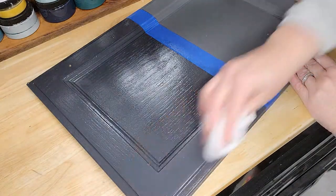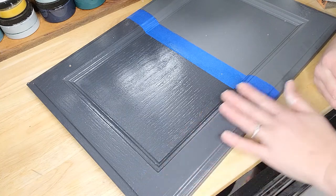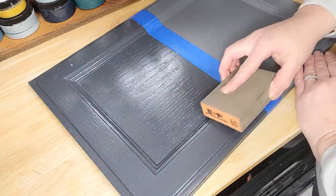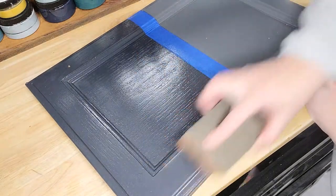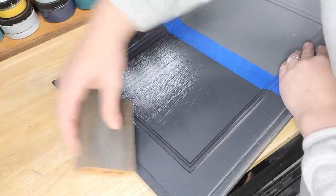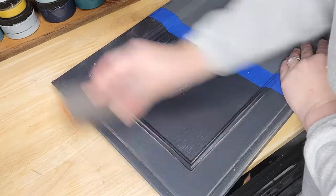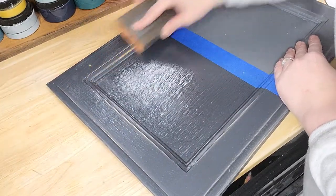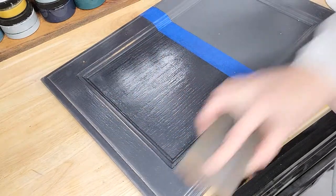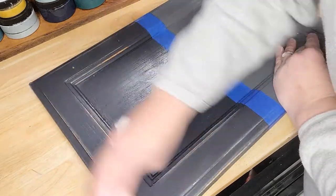It's like baby soft when you're done. You buff off the rest and notice I didn't take any paint off — I didn't distress — I just did a wet sand over it with a really fine sandpaper and it is super smooth now, like baby soft. But you can go a little bit heavier on the grit to distress, going right over those edges, exposing some of that wood underneath just to add a little character to your piece. When you go to buff it off, it's going to be nice, smooth, and distressed all in one step.